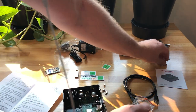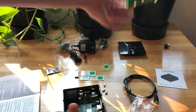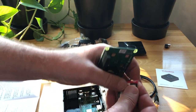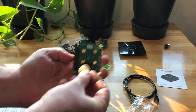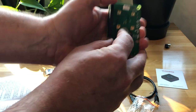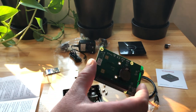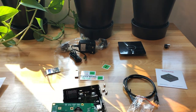Next, according to the instructions: insert the battery into the battery holder. The battery holder is on the bottom of the additional board — not the Pi board, but the extra board that came in the box. You can see the battery holder there. We take the battery and put it in, making sure it snaps well. That's the battery that will keep the Raspberry Pi's clock running even if you disconnect it from power — just like a PC. Most small boards like Raspberry Pis don't have this built in, which is why there's an extra battery here.